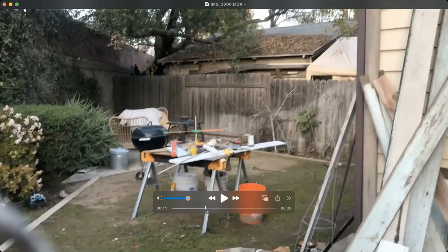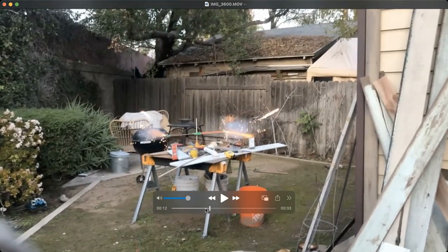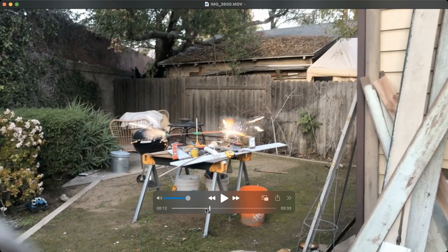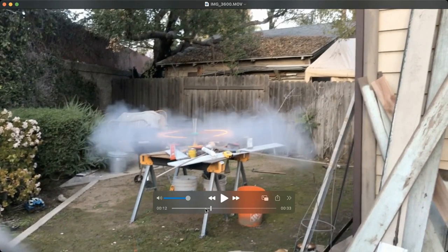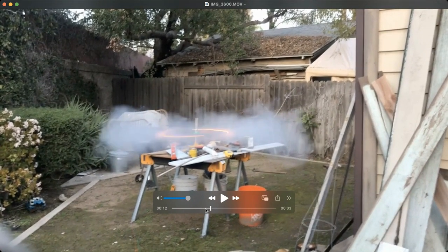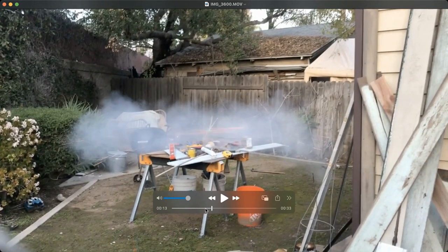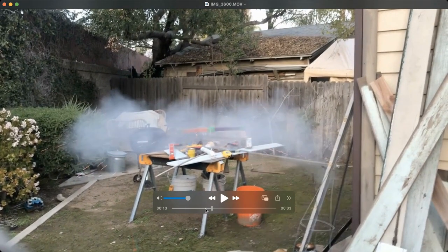This is the first test flight of the helicopter. Right now, everything is on a wooden dowel and it's clamped to a bench, powered by two A-size motors. Doing this frame by frame: the first notable thing is both motors ignite at the same time, which has never been done before. It starts spinning and then our first problem is the wood dowel is bending a lot — maybe bending 20-30 degrees — and then after that it just breaks. It just cleanly breaks because of the oscillations. The rotor actually lifts up a little bit before it spirals out of control because there's no static stabilization.